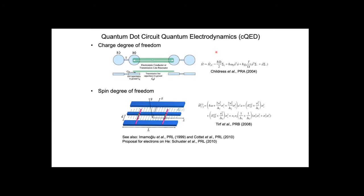On the heels of the Schölkopf and Wallraff demonstration of vacuum Rabi splitting with a superconducting qubit, the semiconductor community quickly hopped on that idea. Several theoretical proposals illustrated ideas for coherently coupling two charge qubits—semiconductor double dots coupled to a microwave stripline—showing that you could have a coherent interaction at long distance mediated by microwave frequency photons. The trick to extend this to spin is to use a combination of electric dipole coupling and some kind of spin-orbit coupling, as in the proposal by Trif and Loss using the intrinsic spin-orbit coupling of indium arsenide nanowire.